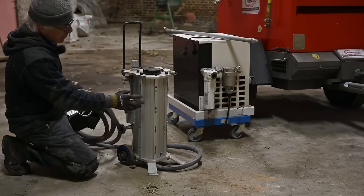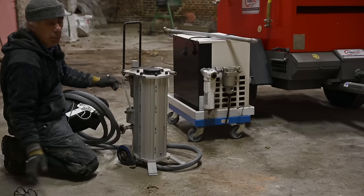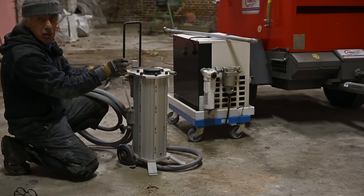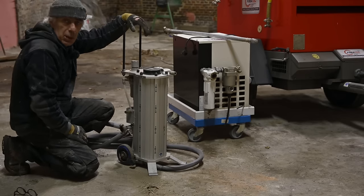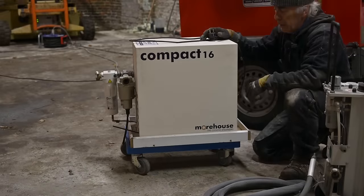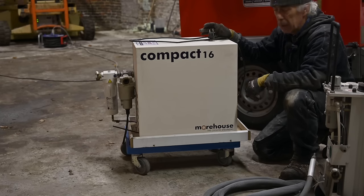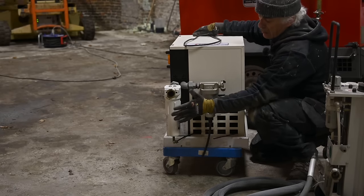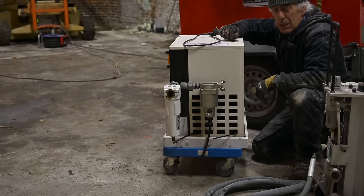We need a container to put the media, the Garnet, in. I'm using an IPEX system — you may have seen this before when I was shot blasting the body of old Rusty the car, and I've also used it for shot blasting oak beams. Here is the gun; you can change nozzles wide or smaller depending on what you need. The media goes inside and it's very handy. But you can't use this directly from the compressor because you'll get condensation inside the hoses, which is the worst thing. So you need an air dryer. It goes with the size of the compressor — the bigger the compressor, the more air volume, the bigger the air dryer. The humidity gets drained out, drying the air before it reaches your gun. So let's hook it up and see what happens.